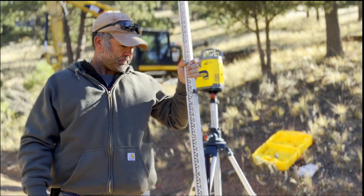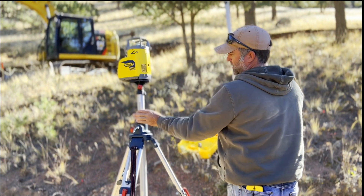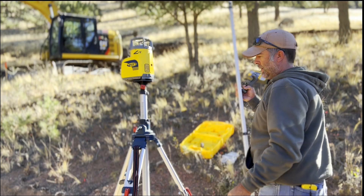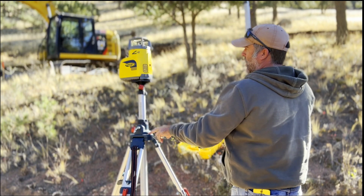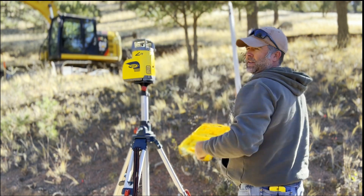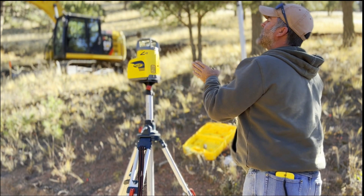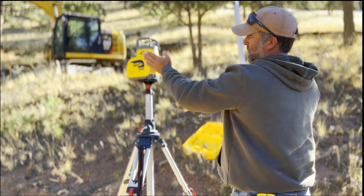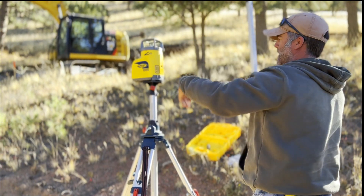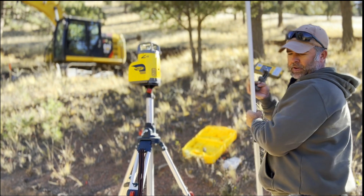The first thing I did is I set it up. We try to set the tripod up level because then if you need to use the elevator, it doesn't change the laser that much. This laser has alignment marks on the top for both axes, basically like sights on a gun. I've got that thing sighted kind of up the general line of this road where we're going to be working. Obviously there's a curve in this road, but I've got it generally set up basically in line with the road, parallel.